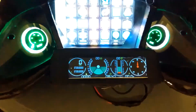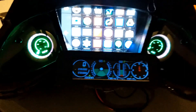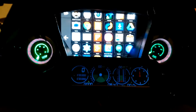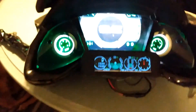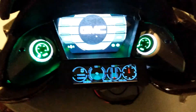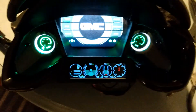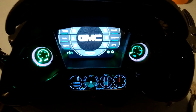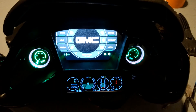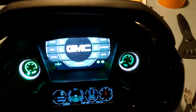One last thing about the tablet: if you want to use a tablet as your dash display, besides a way to control it externally, you need a way to power it on and off quickly. You can't touch the screen, so you can't just press the power button normally. One approach is wiring an external momentary button switch — I have one right on the top — by soldering a couple of wires directly to the tablet. However, when you start taking tablets apart and soldering, you're really messing with the integrity of the tablet. You can burn holes easily if your soldering iron is at the wrong temperature.